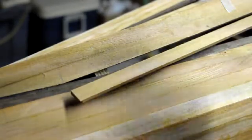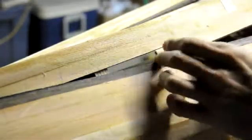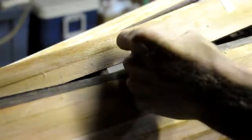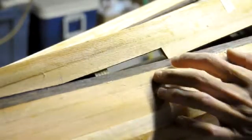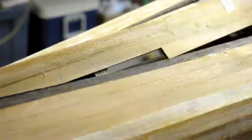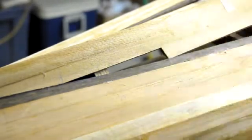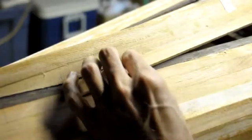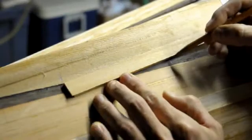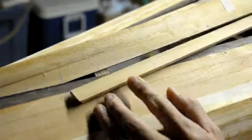Now what I'm going to do is create the taper. In order to get an estimation of the angle, I'm going to slide the piece back and push it in as far as it can go — about like that — and I'm going to mark it on the adjacent piece. Then I can re-line it up with the registration marks and the end of the slot, and transfer that mark I just made to the piece.